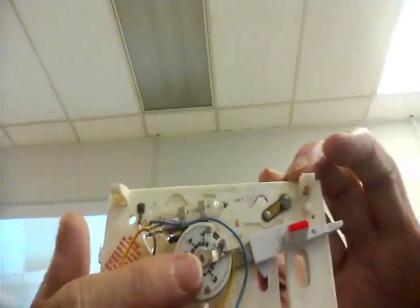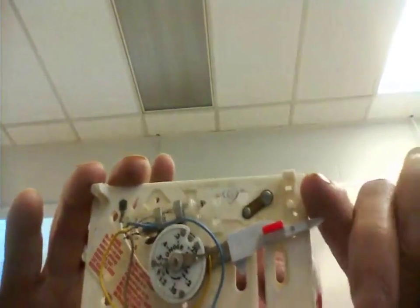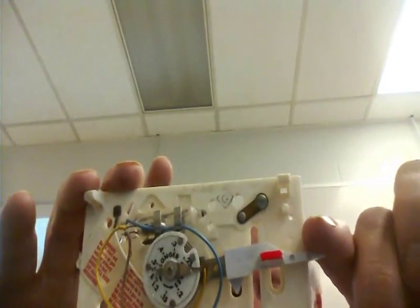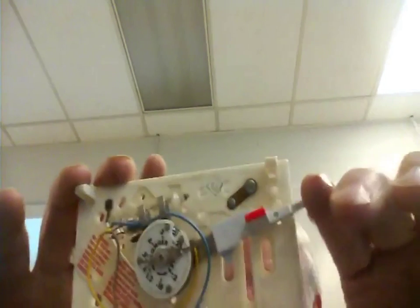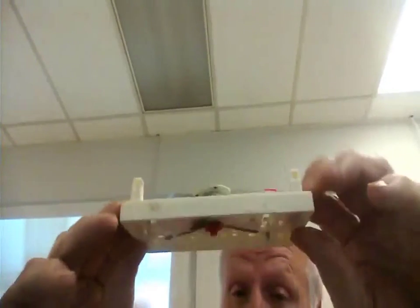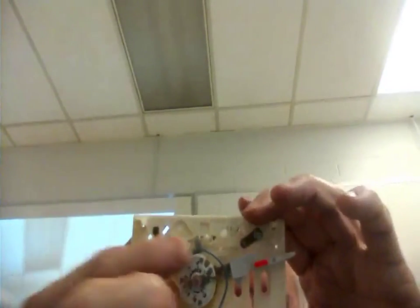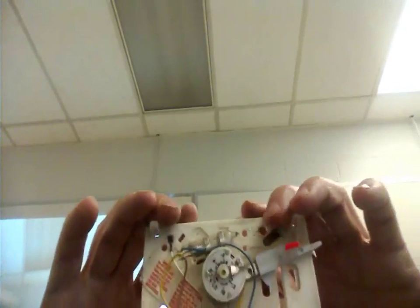You calibrate it right here on the inside, and the knob on the side is where you actually set your temperature — all you're doing is adding or reducing tension on the calibrated spring. This is still found in a lot of older houses. You can still get mercury switches but they're not used much in homes anymore because of the danger of mercury, which is a neurotoxin.